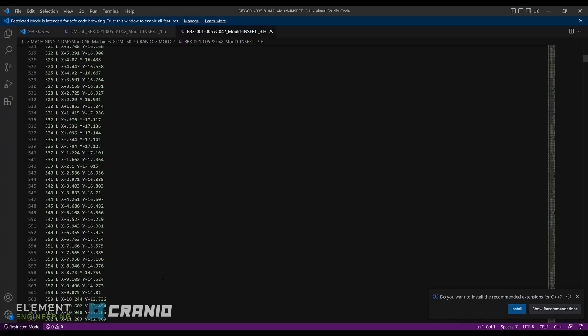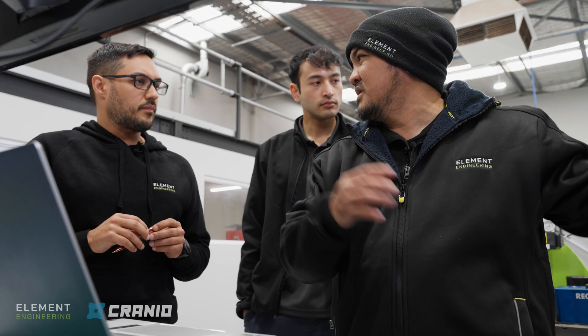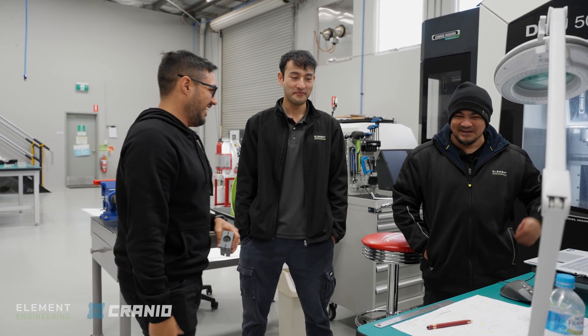When you're scrolling through the final G-code, you're looking for whether the machine is going in the right direction. If you made the program you know where it should be going, so when you run the machine and it's going the wrong way, you look at the G-code and check the specific starting position — whether it corresponds with the machine and the program, confirming it's in the right direction and what coordinate the machine is using. That feature there is only 0.6 of a millimetre. That's one thing that's always misleading with CAD — the size of things. You think it's huge, then you realise it's tiny. With IoT parts, in CAD it looks reasonably sized, but it's tiny. Same thing the other way when you're making truck trays — in CAD it looks cute but it's a monster. Let's do some machining.